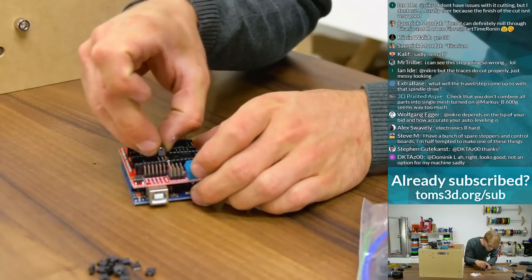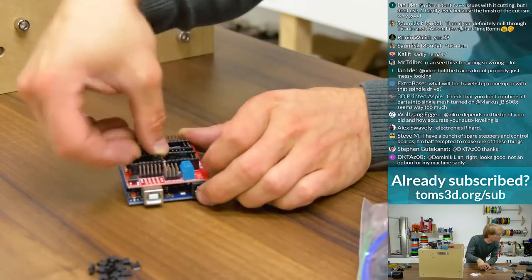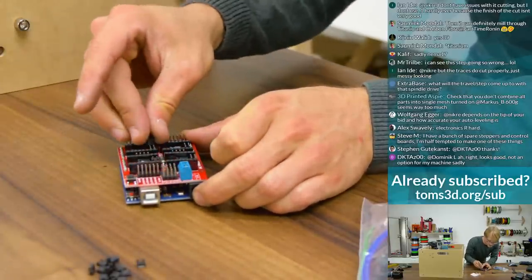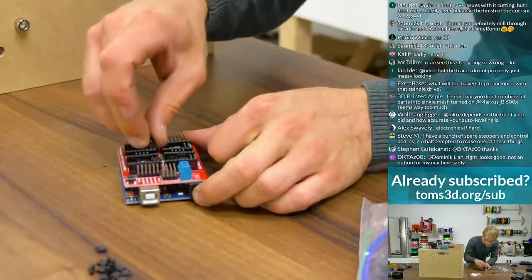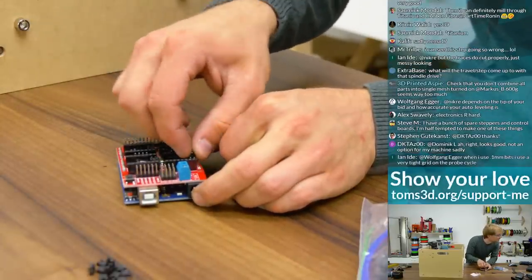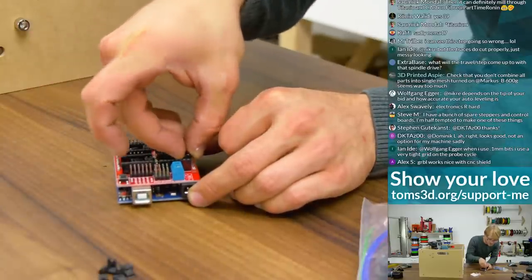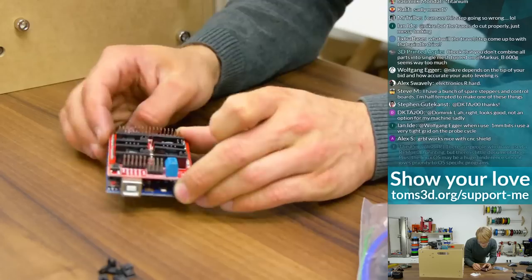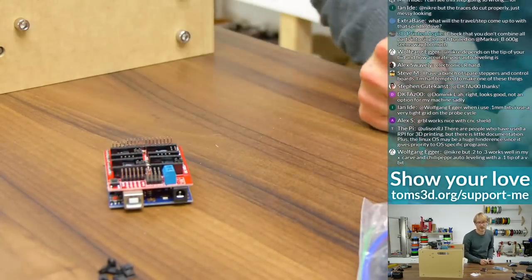So, one, two. So that's just microstepping, and having two jumpers on, I think, is 8 times microstepping. Might be 4 times. I'm not quite sure about that, because I never change it on my 3D printers. 3D printers always run in 16 times microstepping, all three jumpers in. Does it have a table on here? No. So yeah, two jumpers, either 4 or 8 times microstepping, I think.